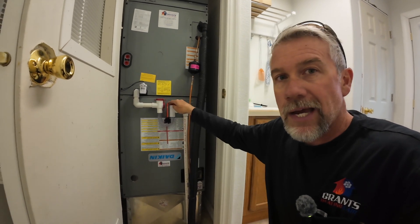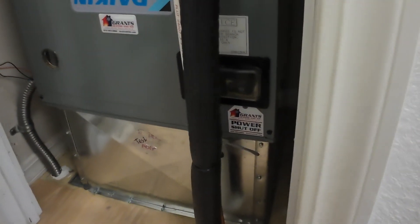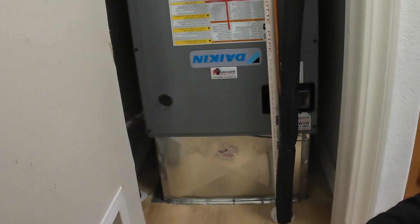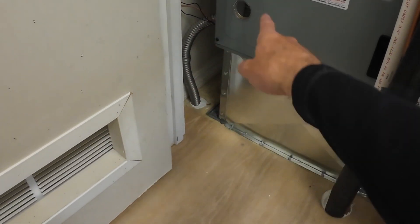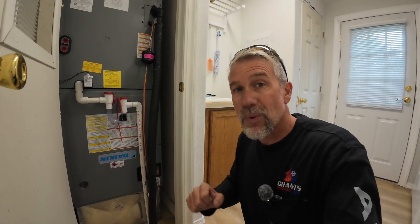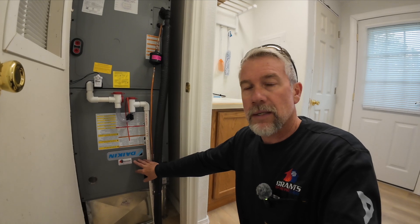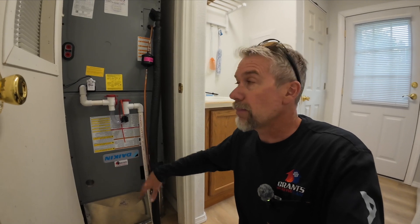There is a breaker over here on the side — this is a 60-amp breaker. There is an 8kw heat kit in here as a backup heat source, and you can see the new conduit that's come up from the electricians to wire that for us. So we have backup heat in here as well as the heat pump. That heat pump will run down to negative 20 degrees, but it's going to need some help, especially if they bump the temperature up a few degrees — that's where the 8kw kit comes into play. Or if there's ever a problem with the outdoor unit, we have the 8kw kit here to back it up.